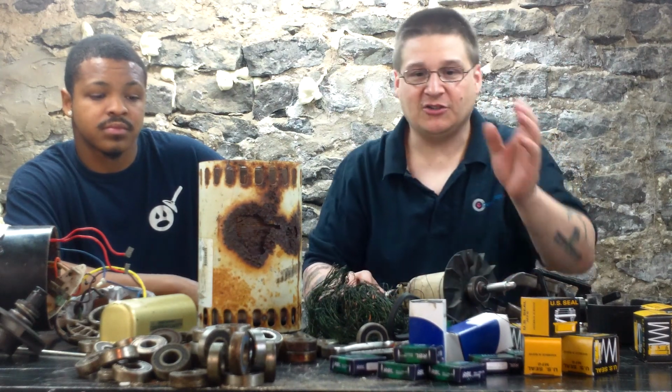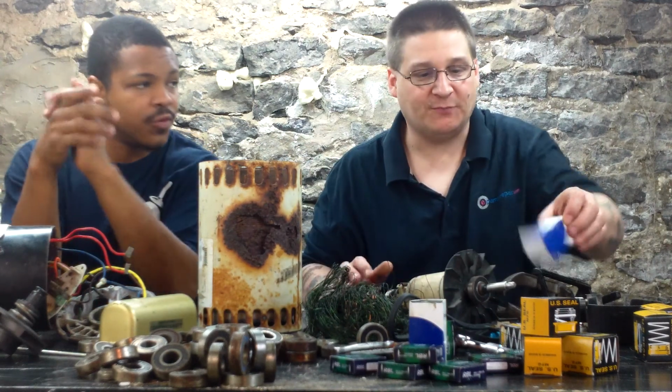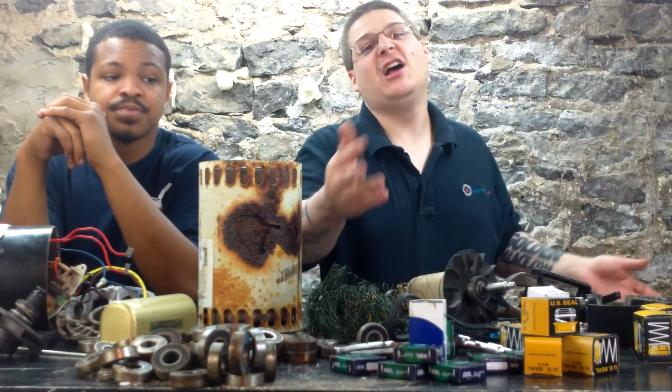Now, sometimes that's the problem. Now, the second problem is there's a capacitor that's located on these motors that we showed you on the videos. They go bad and it won't let the motor start up. Now, how do you tell the difference, you say to yourself? How do I know the difference?